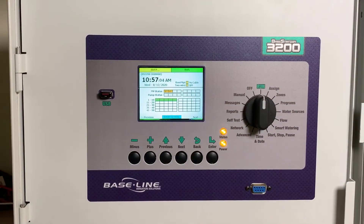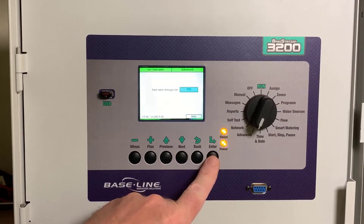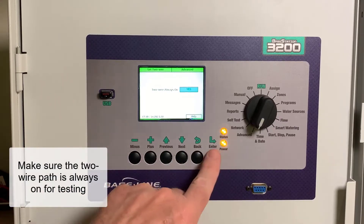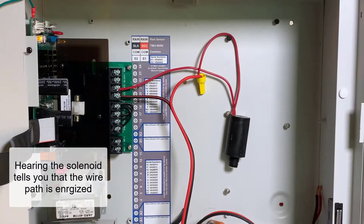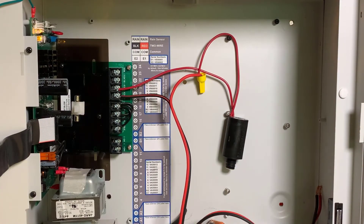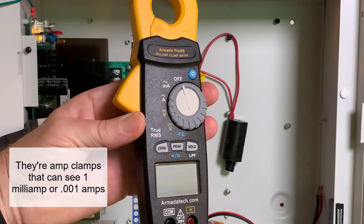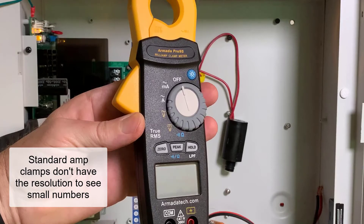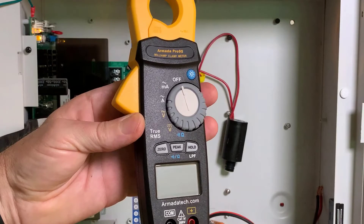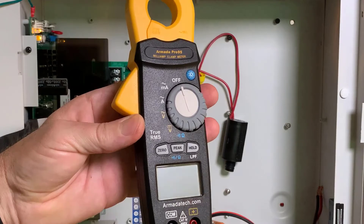With the controller powered back up, notice that the overcurrent message didn't show up, but that doesn't mean the problem's been fixed. Turn the dial to the advanced dial position and open the two-wire settings menu. Anytime we're working on two-wire issues, we need to make sure the two-wire path is always on. The BaseStation 3200 two-wire path is not always energized — only when it's actually running. You may hear the solenoid click or buzz and feel that it's activating, which means the wire path is energized. The tool we're going to use is a milliamp clamp meter, which is an amp clamp that has the ability to see 1 milliamp or 0.001 amps. A standard amp clamp won't have that resolution to see the small numbers we're tracking down. The most important thing about the milliamp clamp and solenoid process is that it allows us to do non-invasive testing — I don't need to break any splices until I've found my bad device.